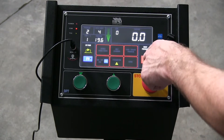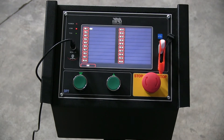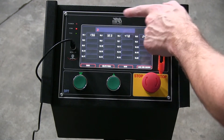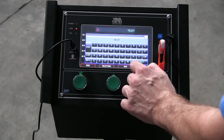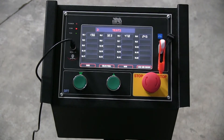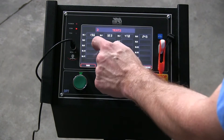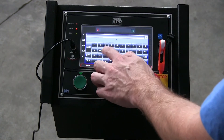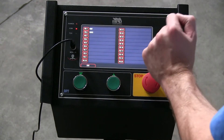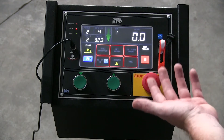I'm going to hit the R button to reset. Now we're going to go to load/change program. Program one is named 'test.' I modified program two, so I'm going to enter on program two — you can see our four positions. There is no program name listed in the gray box. You touch the gray box, label it 'test two,' and press enter. Now our program is named. When you make any changes, be sure to save. When I go back, the name is shown in the list. You can delete the program or load and execute.